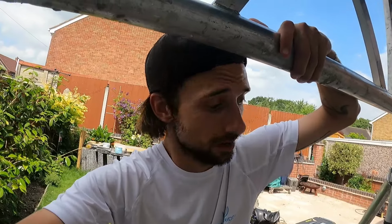So I will soft wash the roof now, and then it's basically just rinse and repeat for the front, exactly the same thing. Take the scaffolding down, tidy up any mess that's left, set up around the front, scrape the roof, clear the gutters, remove the downpipes, put the biocide solution on the roof, tidy up again, mop the gutters out if you want, before you connect the downpipes back up, which you should do really. Tidy up, go home, there we go, simple as that. It's a very simple job, just a bit of hard graft, so I'll crack on.